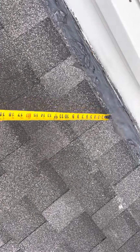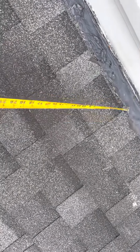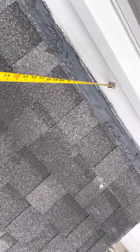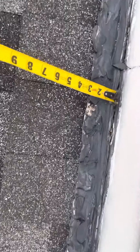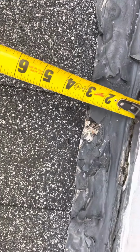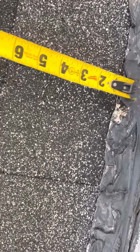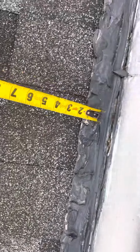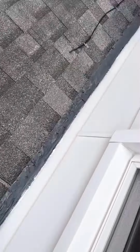So what we're going to do is about every 2 feet or so, we're just going to take and chisel a path for water, so we can get it down to that mill colored aluminum. Not going to bother sealing it because that aluminum flashing goes up underneath this siding. Just give them like 3 or 4. You can see how this big, so water just sits right in there. So what we're going to do is create, either a flat chisel or whatever, just create a path for the water to come off here, and about 3 or 4 spots through here.